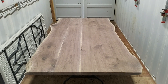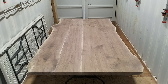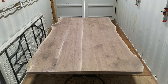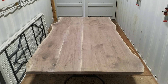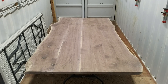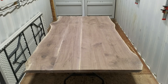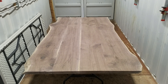We have an eight foot by four foot double book matched black walnut table here. I milled the boards out and put the table together within a few hours. It's very important to clamp the table up as soon as you get the boards milled out and cut. This morning I unclamped it after setting the clamps for 24 hours and the glue up, and I'm getting ready to apply a few coats to the bottom of the table.